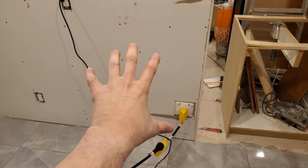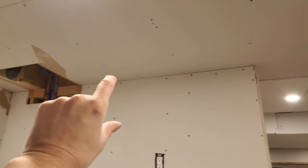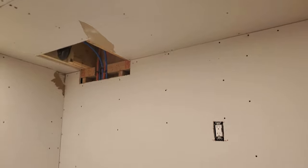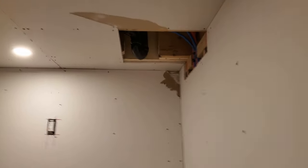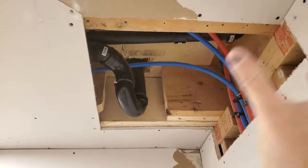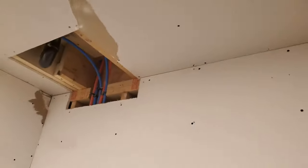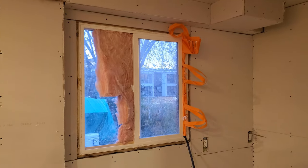This is where I intend to put the stove. The vent will be going up here, so I'm going to have to build another bulkhead along here to accommodate the vent run to the outside. I had a bulkhead up here but I've taken it down so it's out of the way. The p-trap under the shower should not be any kind of obstacle, so we'll build a new bulkhead that will accommodate this and the vent.